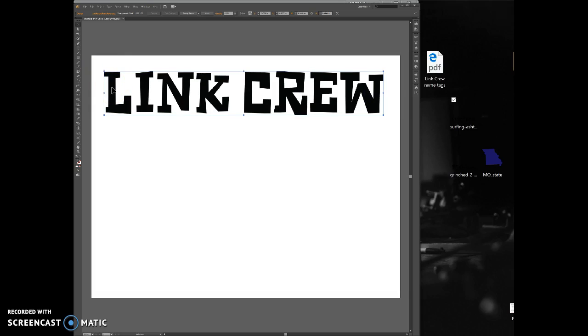All right. So now if I wanted to cut, say, a rectangle out of metal and cut my lettering out, I'm keeping all the white, and the black is going to fall away and be scrap. Keep the white. I'll look for islands. L is good, I is good, N and K are good. Here, the R. When I cut, I'm going to have this little chunk fall and then not really work. I'm going to keep this thing intact. So I'm keeping the white, keep the white, and keep that white.